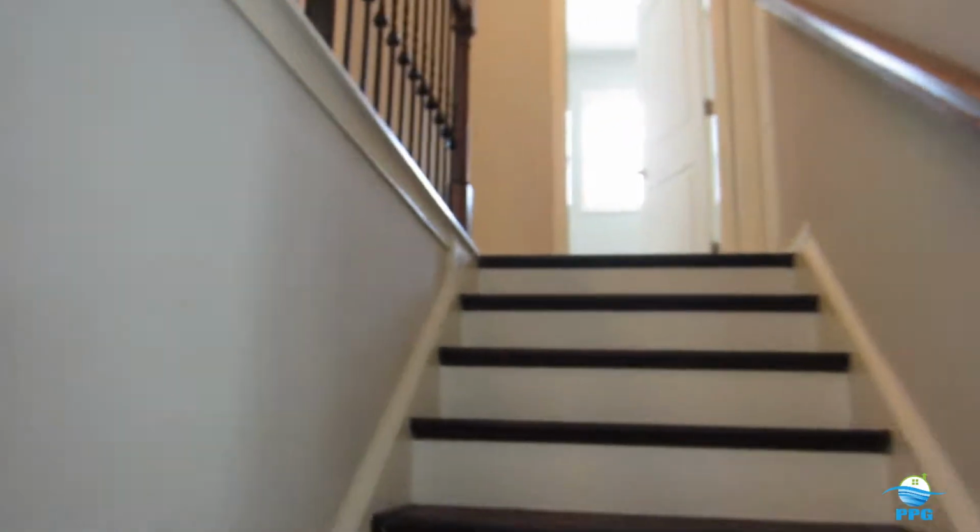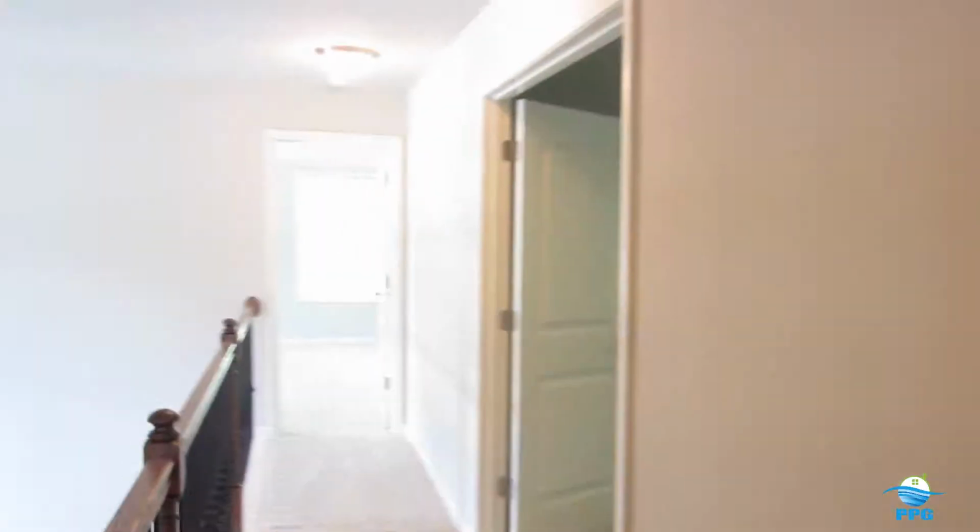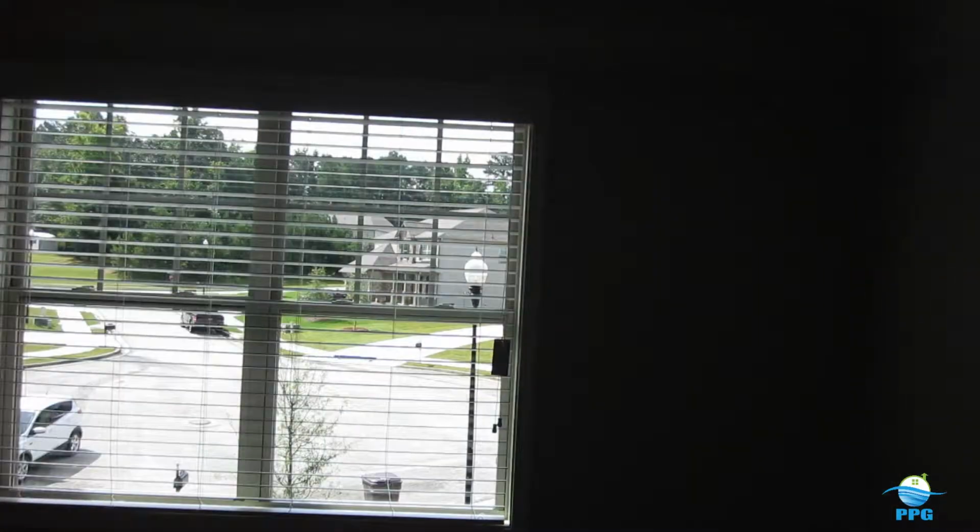Like I said, this is a brand new home. I'm doing a final on this one. It's got 2 levels. We're talking about tamper-resistant outlets and ground fault circuit interrupter outlets. Tamper-resistant outlets are required in every, and I'm gonna go into a little more detail, we're gonna talk about arc fault circuit interrupter outlets and breakers.